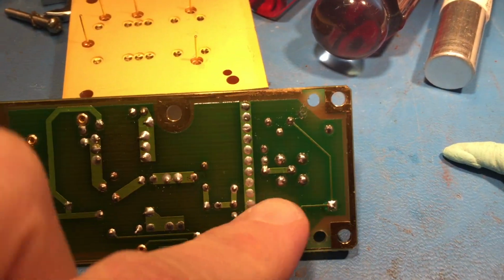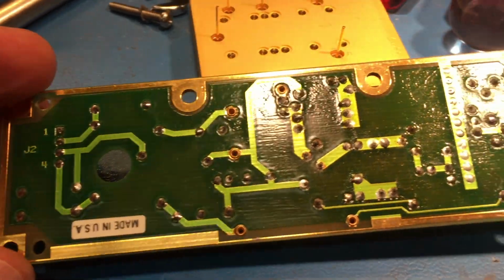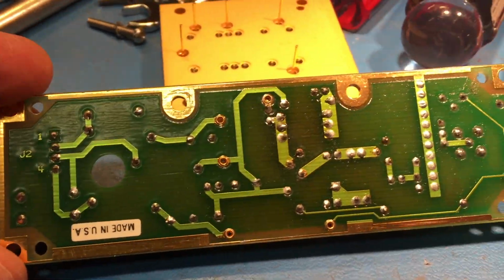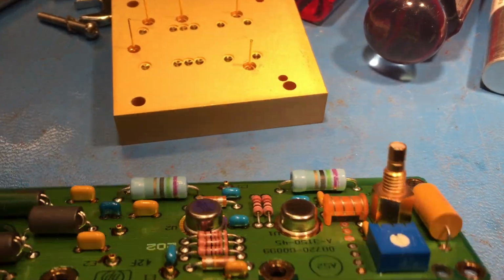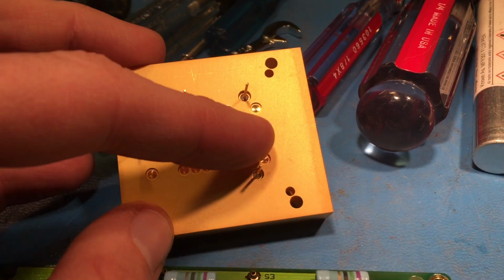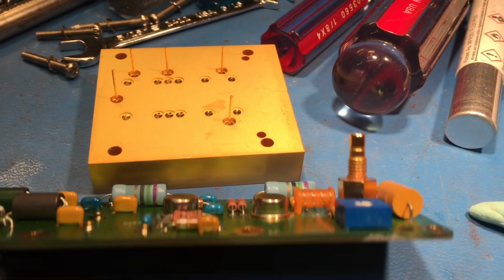But I'm thinking maybe something here screwed up. The only real thing I found was that the 4 grounds here were really not soldered on well. And there were lots of little solder balls all over the place, just everywhere, from the rework as well as from who knows what else, original assembly. I could imagine that one of those may have been shorting out. So I looked in here, I saw a couple of those little solder balls around this pin, one of these pins.